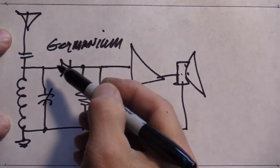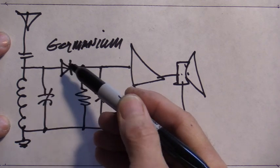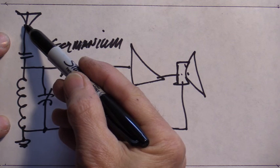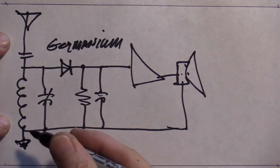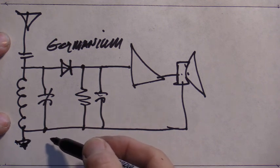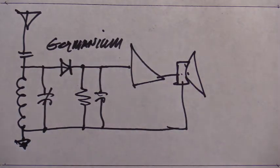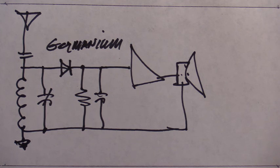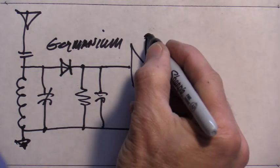What I'm saying is, with this basic radio receiver, you're going to need a long wire. And you're going to need a ground, like a plumbing pipe or a stick in the ground, you know. But with a FET AM radio, you don't need those. You don't need a long wire. You don't need the earth ground. Of course, you're going to need some kind of power up here.